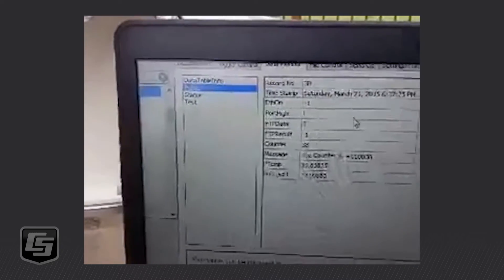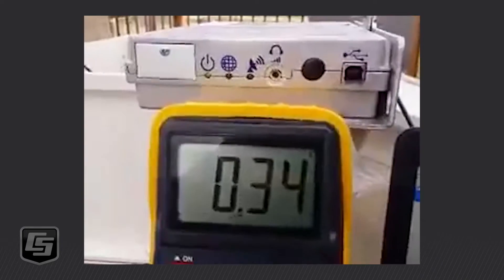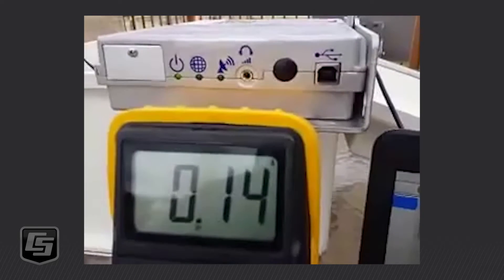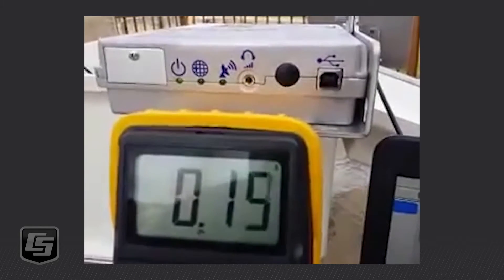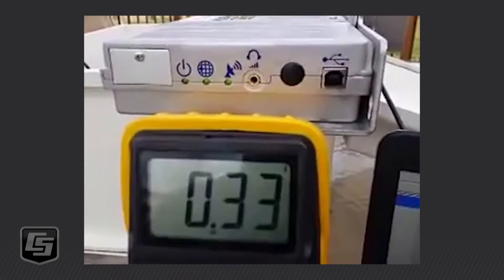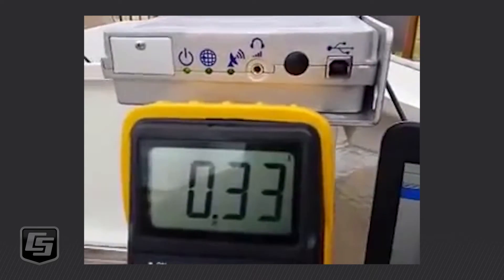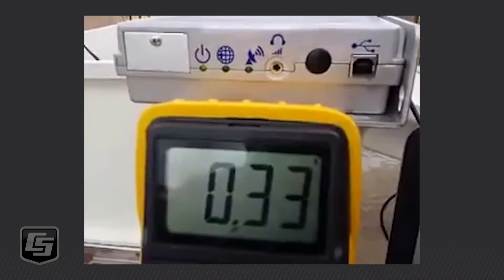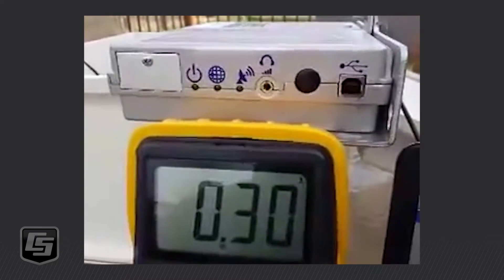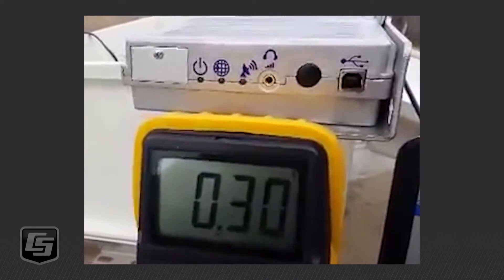You can see if I take that pin 9 back low, it starts the boot process all the way over again. So it takes probably two minutes or so, depending on your signal strength and how well you have the antenna placed and everything. But it goes through the whole cycle that we just viewed at the beginning of the video — it's going to start blinking the power light, then it'll start blinking the location light, and then the satellite. And once it has a fix again, we can push data again.